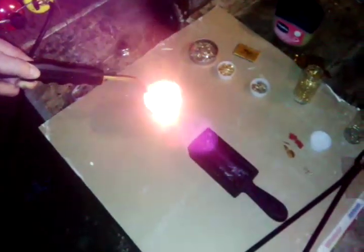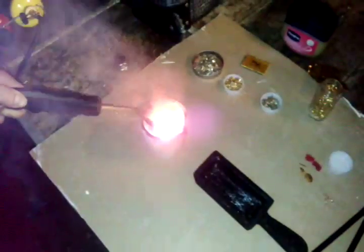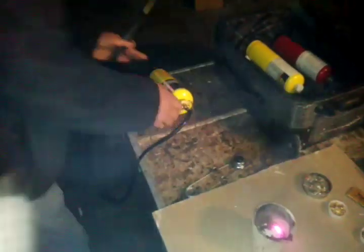Now I'm going to add some borax. As you can see, we're getting a little bit of melting — pretty intense. Adding borax will get rid of any impurities; you want to do that after you start smelting. Matt is going to turn the oxygen off first, which is very important — otherwise you'll get a blowback when you try to relight it. Let it sit for about 30 seconds. As you can see, this is starting to melt. You hear that? That's the sound of gold — doesn't that sound nice? Money.